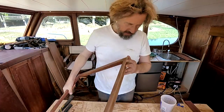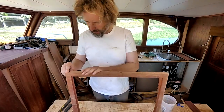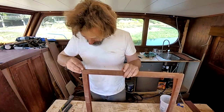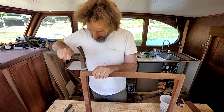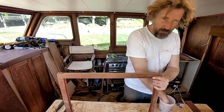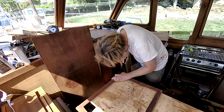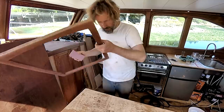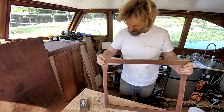I've just done a little bit of sanding to make sure that it fits perfectly in the cabinet and it now does. I've got to do a little more here because I have a tiny little blade burn to get off. But it's time to put some plugs in because all the adjustments are done. These are going to be fit dry as well because there will be plenty of varnish and such to keep them in there. Very nice.